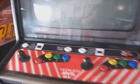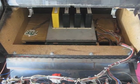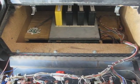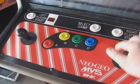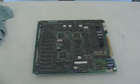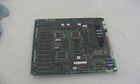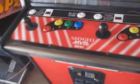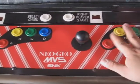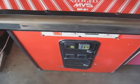Now, if your Neo Geo cab has a multi-slot board, such as that one right there — that's a four-slot — then no, it is not recommended that you run a PCB in the Neo Geo cab. It is wired differently. Your visuals will be the same; that's not going to be affected. Your joystick, buttons, start button, and coin mech will all be fine.